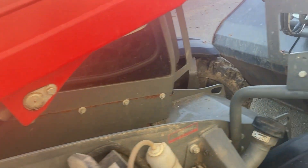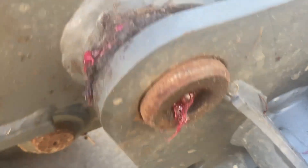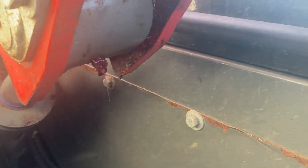I've just greased it all up. You can see the grease coming out here from this nipple here. I've got another nipple there — there are several around the machine and I've just done them all. So that's all ready for cleaning out the pigs first thing tomorrow morning. We've also greased up all the bucket — there are six on there, one there, one there, and one down in there, same on the other side. All on there: headstock, the locking pins, all of the top of the axle, and the ones underneath the boom as well.